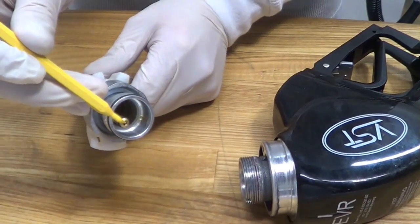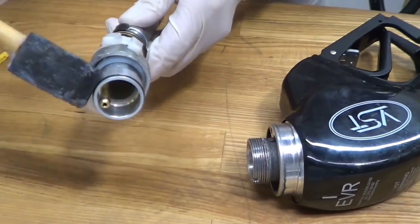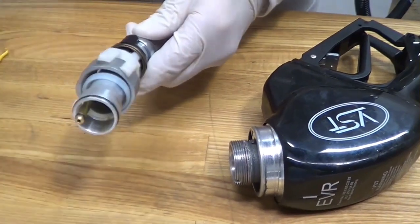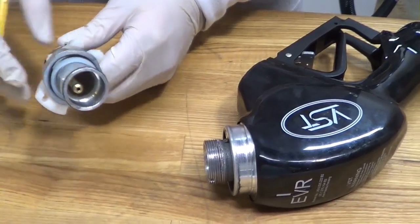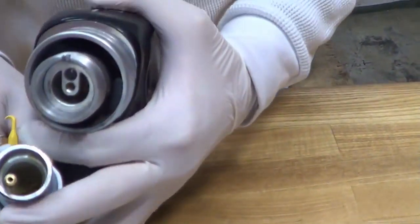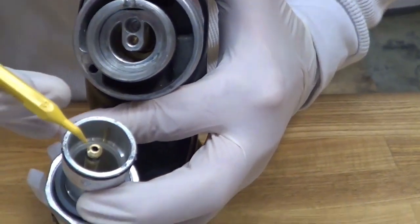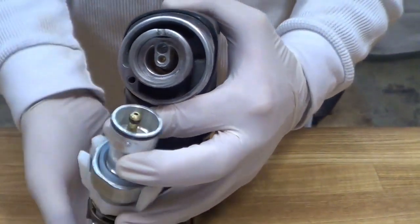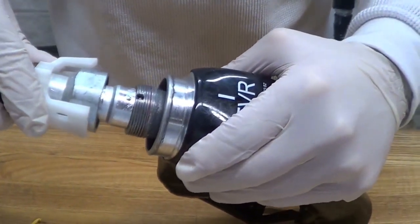Align the vacuum sensing tube with the mating hole in the fuel chamber. Align the anti-rotation bump on the spout with the casting notch. Be careful not to damage the spout O-ring. Firmly insert the spout assembly into the nozzle casting.